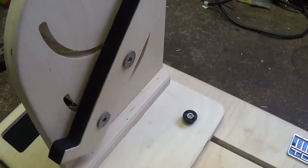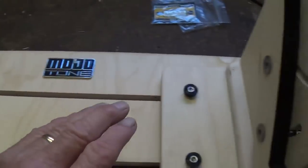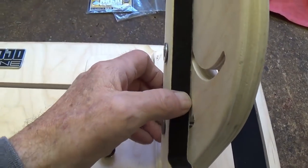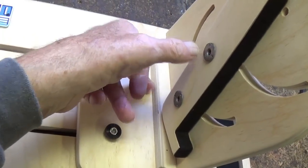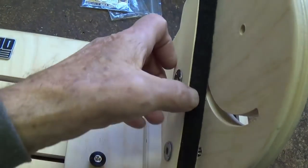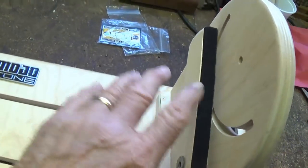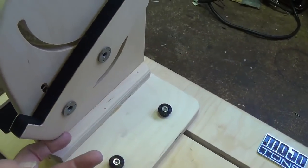Also, another benefit that this has is that this piece restricts the travel of the chassis that way. This piece restricts it that way. So when you kind of wedge it in between these two uprights, it cannot possibly move left or right and fall off of one of the uprights, which it really can do with the homemade stand. So you can operate it with the pivots at a low position like this, which would be best for me. I have a fairly high workbench, so I don't really want this thing way up in my face. Or if I had a shorter workbench, I'd move the pivot up to here and move the locker into that routered arc, and it would be up here moving back and forth. So you've got height adjustment, tilt, and sure locking in of your chassis so it doesn't fall off one end and crush your Amperex 12AX7s.